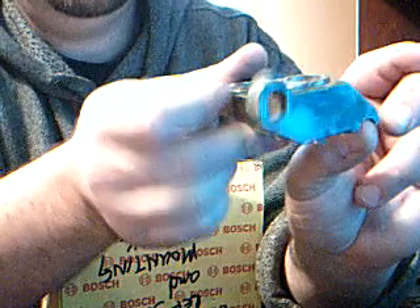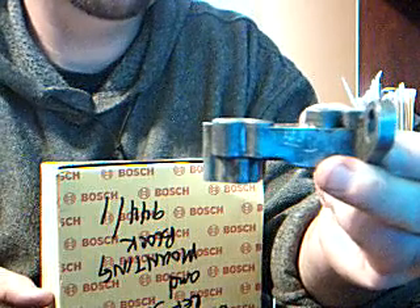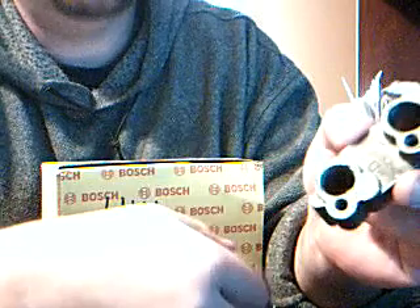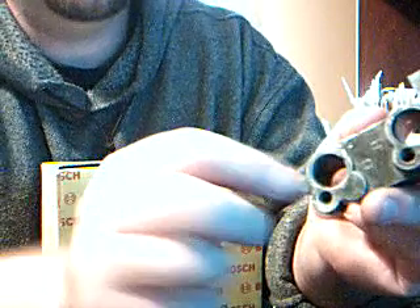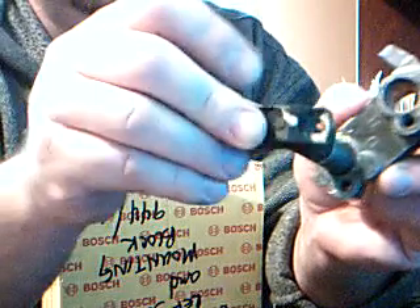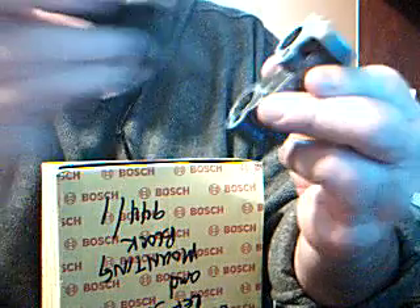This broken block could still be used — seated up on top of the sleeve and mounted with the other side — but because the calibration on these is so difficult, it's obviously not desirable. If you do have to take it off, I recommend taking a Dremel with a small drum sander and polishing the inside of these sleeves, just to take a fraction of a millimeter off so the new sensors can go in and out easily.